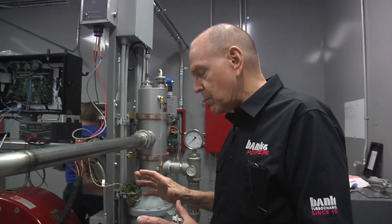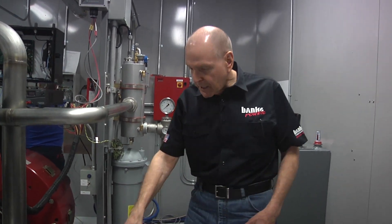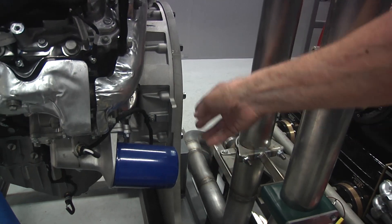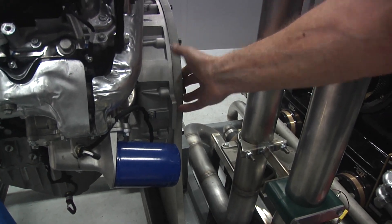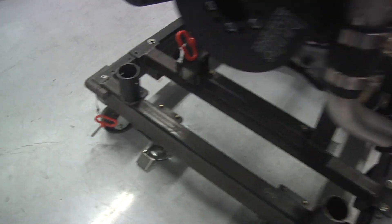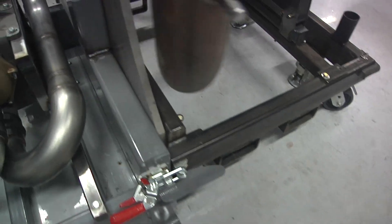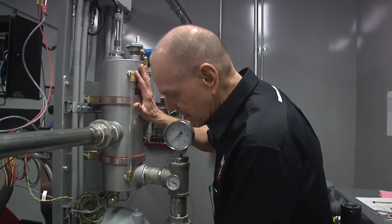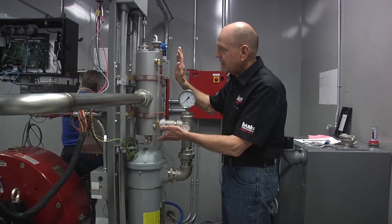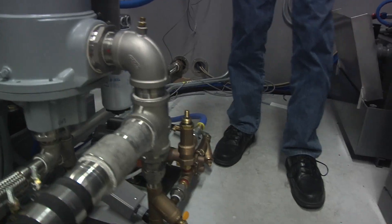What do we do here that's kind of clever? We run the engines in on carts that we developed, which dock right here. You see the back end of the engine is bolted to this plate, which is part of the unpainted cart. The cart rolls in and dowel pins to the gray chassis of the dyno. This is the cooling jacket water — what you would call the radiator in a truck — and the expansion tank here.